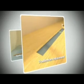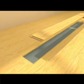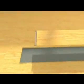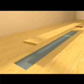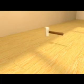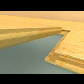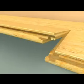9. Trouble-free replacement. Where one panel in the middle area is broken, Tap-and-go offers you an easier way to replace it with a new one. After fetching out the broken one by special equipment, take a new panel, then you just need to saw off the short side low hook and install it conversely. The left 3 sides of the hook can also lock the floor with others firmly.